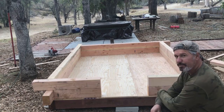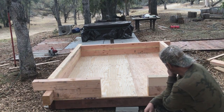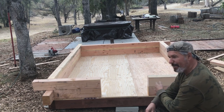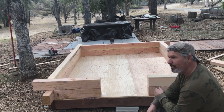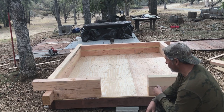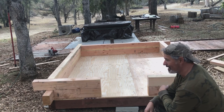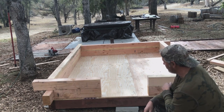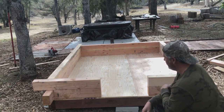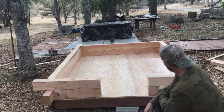Cabin here, which is going to be a steam sauna. It's coming out pretty good. I've got to say I'm pretty happy with it. Like I said, I'm not that good at this stuff, so the beauty of the butt-and-pass is each piece supports the other, and so it's a really interesting way of building because you don't need to frame, you don't need to insulate, you don't need to do the tongue and groove on the inside. It saves you a lot of steps. We'll have to stain it and seal it and do all that, but it's coming out really nice, and a couple little minor gaps which can be caulked and then covered with some trim. You won't even know they're there.